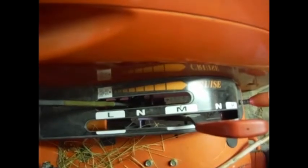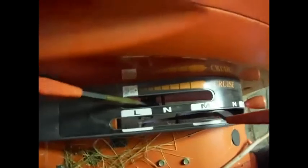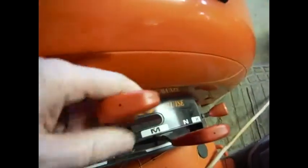Mid is pretty much everything — mowing, driving around the farm, and picking up hay. You might use mid-low, and low we would use for dirt work. I don't think I've ever used low for mowing; I use mid range, sometimes low-mid range for mowing up a hill. Here's the cruise control — you just slide that forward and it stays in place until you step on the brake.